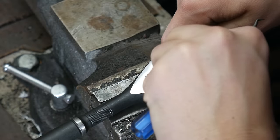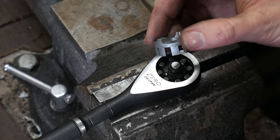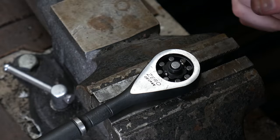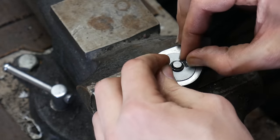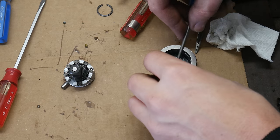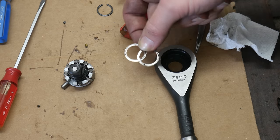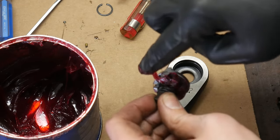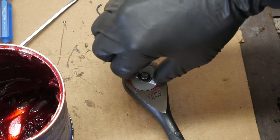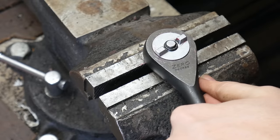Next, we'll repeat the same process with the 3/8-inch ratchet. We'll start by removing the snap ring and the switch. This one uses 8 rollers and is pretty much identical to the half-inch ratchet, only a little bit smaller. We repeated the same trick to stiffen up the detents in this one. But when we went to take it fully apart to clean it, we noticed that there are actually two shims in between the drive head and the body of the ratchet. That does explain why this one feels the tightest out of the three — neither of the other two had any shims at all. Then we proceeded to grease up all the parts and reassemble the ratchet. This one works perfectly and doesn't show any desire to unlock, although the detent worked fine before.